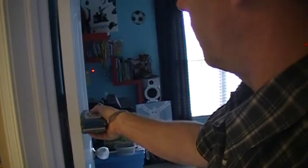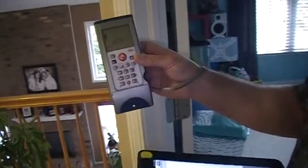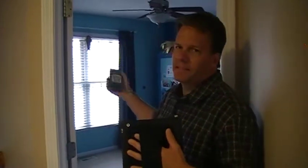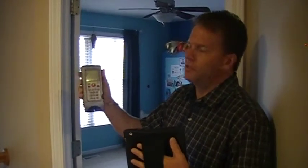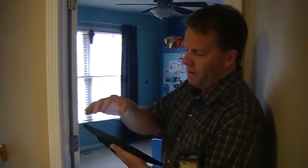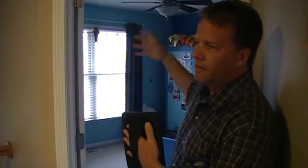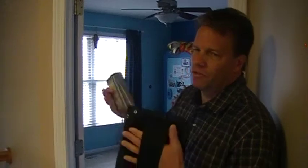Now we're to that door frame. We're going to add again — press the big red button, take a measurement from here, press equal — and you've got thirty-seven feet. Now you should be adding for the drywall when measuring interior walls. They're approximately six inches with the drywall and a two-by-four framing, so you would want to add a foot to this measurement. It's showing thirty-seven, and as you remember from outside we're calling it thirty-eight.